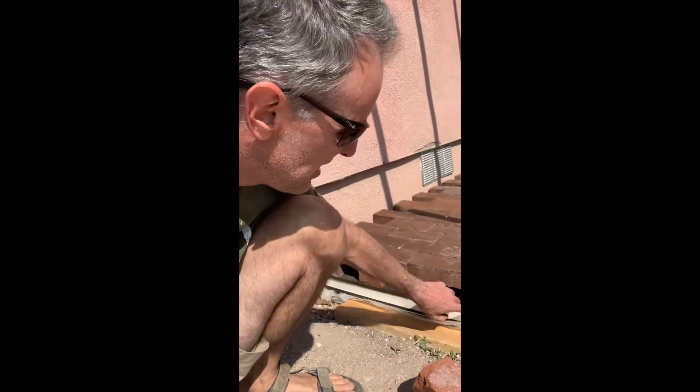What I've done here is put a sandwich of insulation on top of plastic. I have about an inch and a half of closed cell insulation and then two layers of bricks on top. The reason for that is to absorb as much heat during the day as possible. I've painted these bricks — I found them on Craigslist and dyed them a slightly darker color, which actually came out pretty nice.